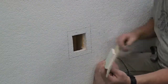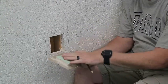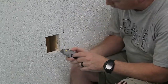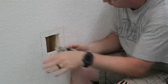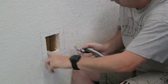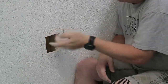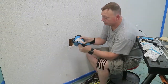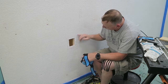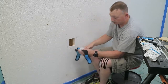We're going to dry fit this thing in our hole and see how well it fits. It looks like we might need to trim - either trim our piece or trim our hole, whichever you prefer. I'm going to cut my hole a little bit since it's still held together with paint and everything. Take your knife and trim it. Now I like to rub this down and get the loose gypsum out so we get better adhesion. I'm doing this because in my mind it's easier to sand the paint off and have the patch sit slightly recessed - then when I skim coat it, it'll require less sanding around there.